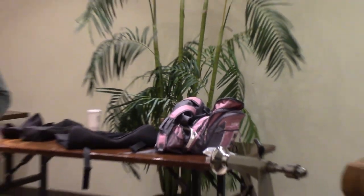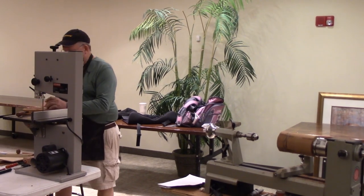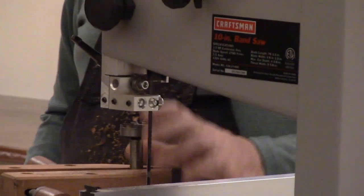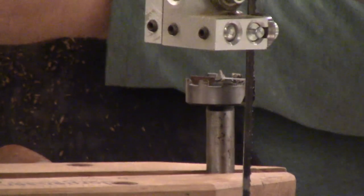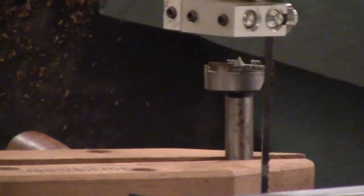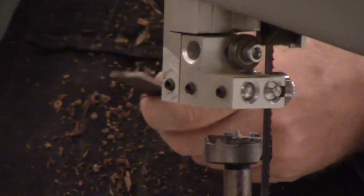Super easy to sharpen. Once you, you don't let them get too dull. You never let them get dull, otherwise you'll be here for a month of Sundays trying to get it sharp again. But just get something to hold it. I'm just using a little clamp. This is a diamond slipstone, and this is the CBN that I got from Ken Rizza, Kenner's one. It's 600 on one side, 1,000 on the other, and I think this stone is probably somewhere around 3,000, something like that, the diamond one.